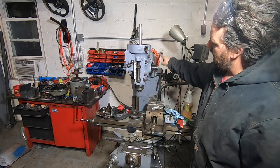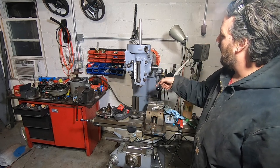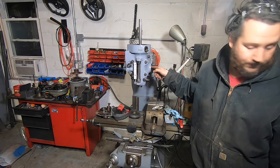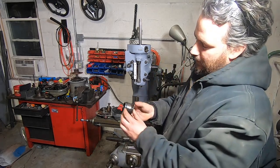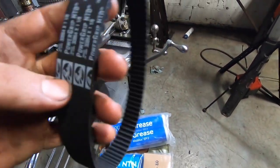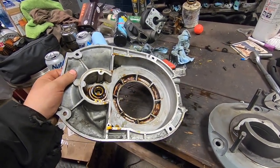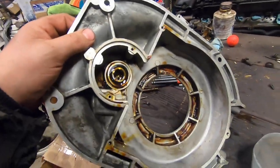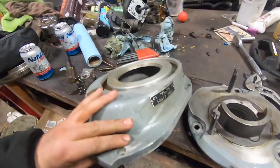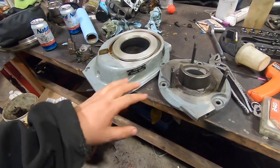Got the quill moving nice and smooth — feels like new. Glad I took extra time to dig into that. Ended up putting a new spring in the quill return; tried to repair the old one but it wasn't worth it. Parts ordered: new cog belt made in USA, some new Mobil grease, because there's a lot of old grease to scrape out. There's a set screw here that's a grease port — it runs to the inside and greases it. I couldn't believe how hard the grease was; if I wanted to grease this, I probably couldn't even make it happen. So I pushed that out and we'll get fresh grease in there.